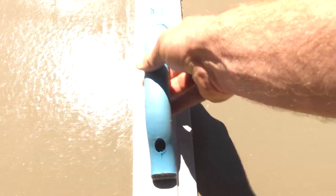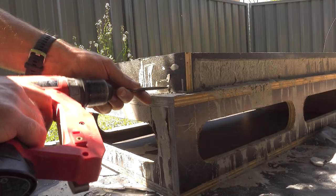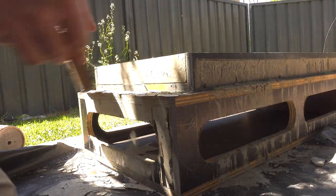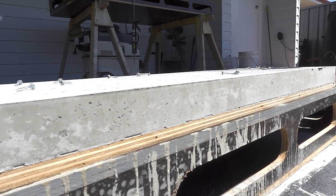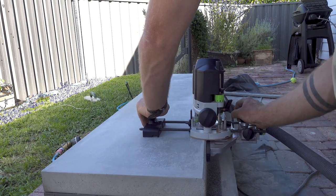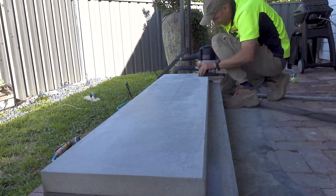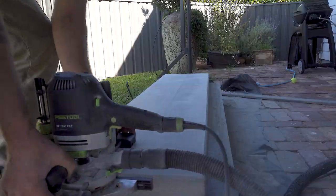I poured this yesterday so now we can strip it. Something I'll probably do on my next one is strip these while the concrete is still green and give it a light trowel just to seal up those holes. Now I'm going to chamfer the corners — router the corners. I got a diamond half-inch router bit. This was surprisingly easy. I got my plunge router with the edge guide and extension to keep it stable, doing about three light passes so you don't damage the bit. I set the router to medium speed, halfway on the dial.